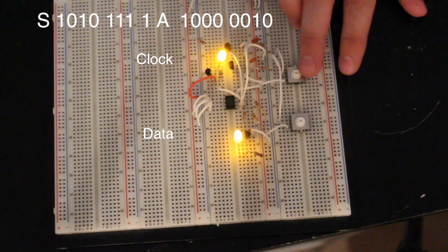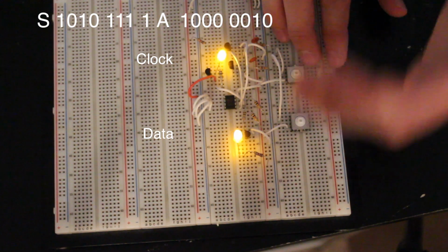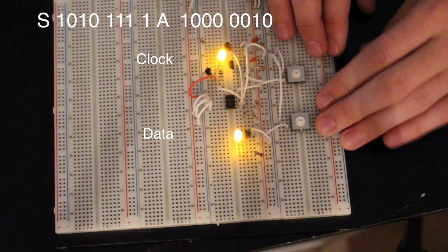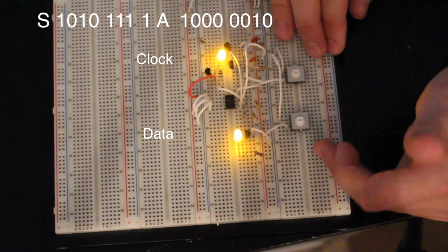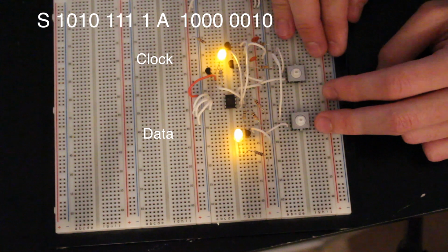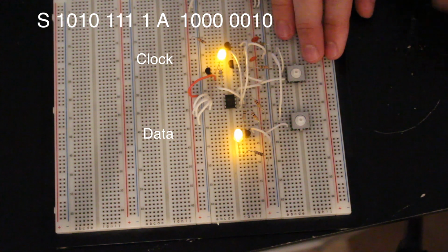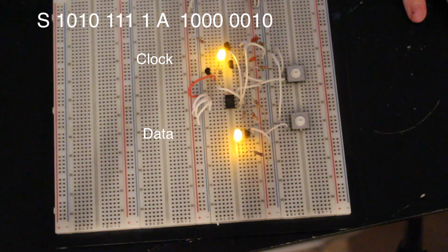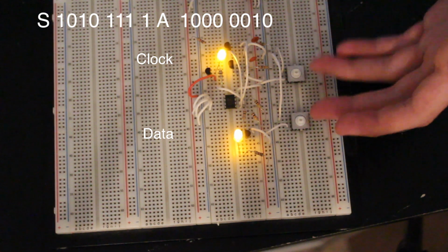And if I kept going here, I believe you can do page writes and page reads where you just keep reading. So right now we could just keep reading from the next address. We just read from memory address 0, but we could keep going, then go to 1, then 2, 3, 4. But I should have acknowledged. I think it's called a sequential read. I should have acknowledged the slave that I received the byte, and then it would have gone on to the next memory address. But right now the bus is stable, so there's no communication. Okay, so that's how it works. That's I2C. Hopefully that made some sense to bit-bang it with the switches here.